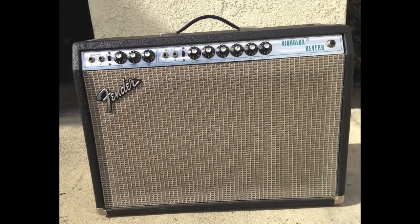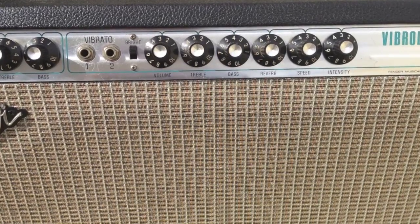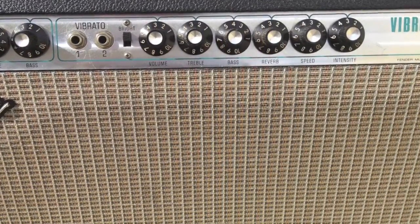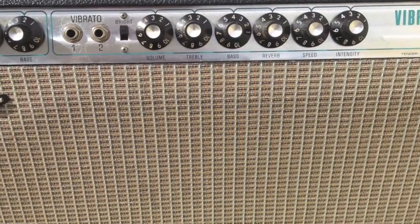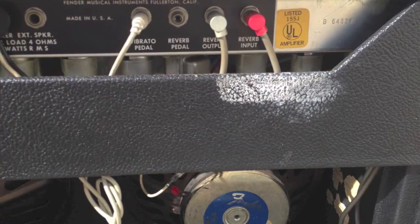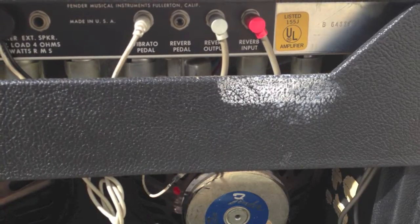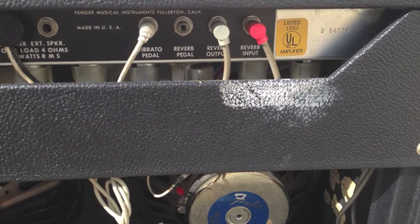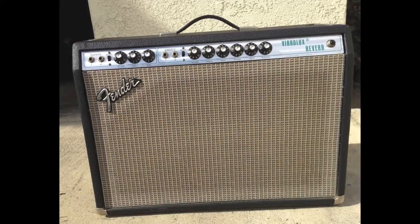So getting back to the Fender website, I also found out that you can date a Fender amplifier, and this includes Silverface and Blackface amps, using the transformer codes. Now, these transformer codes, from what I've read on Fender's website, always begin with EIA 606 and are then followed by 3 or 4 digits in various combinations. The first digit refers to the year, so a 7 would mean 1967. And if 4 digits are present, the first 2 digits refer to the year, so 66 would mean 1966, and the last 2 digits would refer to the week of the year.